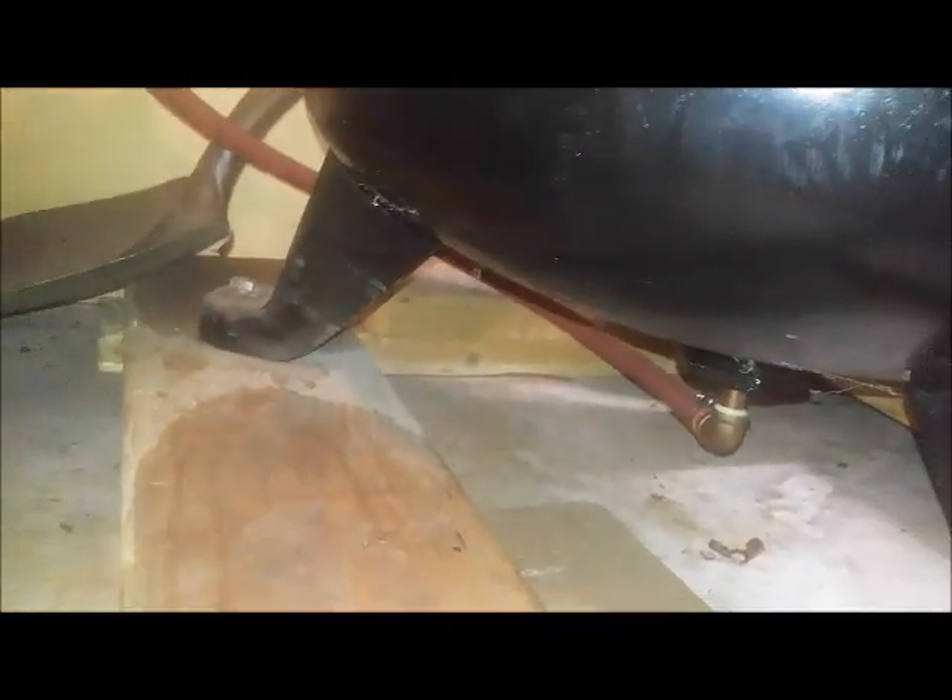What I did is I removed the drain petcock because it was bad anyways and I don't trust them, and I just put a 90-degree quarter fitting, and then I cut a 3/8 hose that comes up here. For now it's just temporary — I'll probably mount this later to the wall, just a hook, so I can hang it there instead of hanging it right from the compressor, but that's where it hangs right now, and that's my drain.